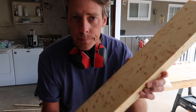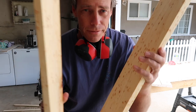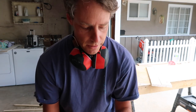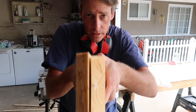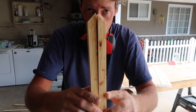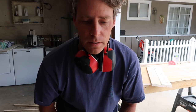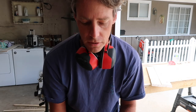I'm using bird's eye pine for the box. The piece I got was fairly straight when I got it, but it wasn't fully cured and it got a little bit twisted because I didn't have it stored perfectly flat — which you really need to do. So my bad. They're a little off and that could affect the operation of this drawer box. A clever person would scrap this and start from scratch with plywood, but I'm going to try and straighten it.